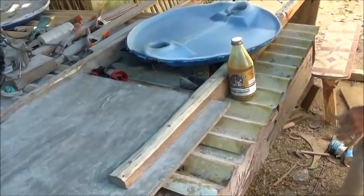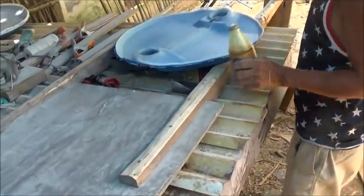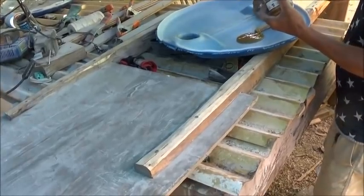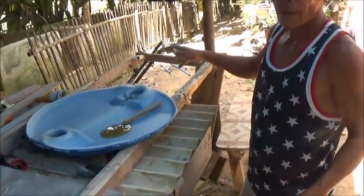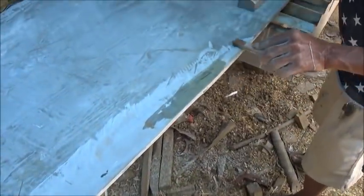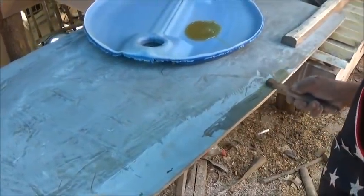I would anticipate we're going to have to change this rubber, not often, but every once in a while, because of the forces involved. The surface it's sliding in and out of is not really that well machined, and it's got great force against it, but it is what it is. This tube was 150 pesos, so it's not prohibitive. Even if we had to replace it once a week, 150 pesos is not out of line. I don't think we have to replace it once a week, but we might have to do it once a month or every other month or so.